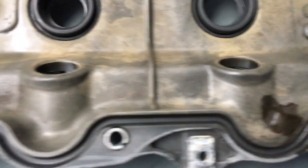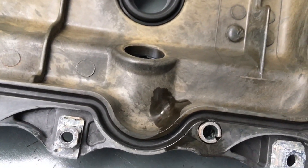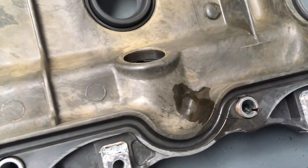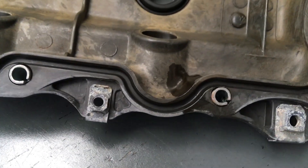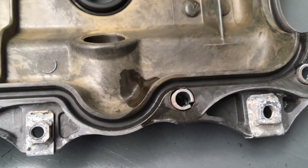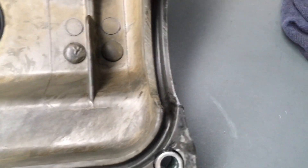The other thing you can do is clean that oil off and put a smear of gray max RTV — hide the problem, basically. It will work. If it's clean and dry it will stick and seal it. You can do a little bit on the inside, let that dry, and then when you put the gasket in, directly before putting it on, put a little bit of gray max RTV underneath where that gasket normally sits. It needs to be bone dry.